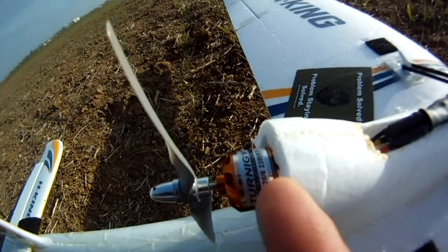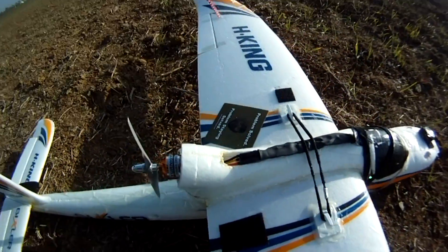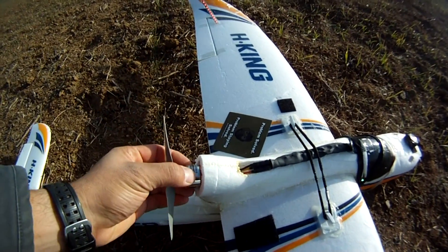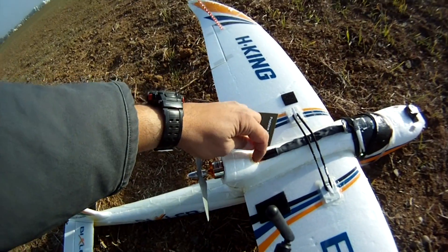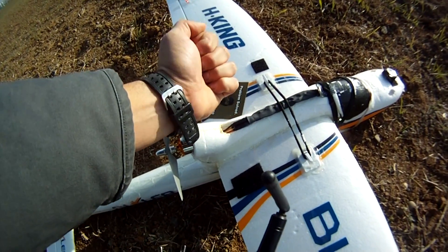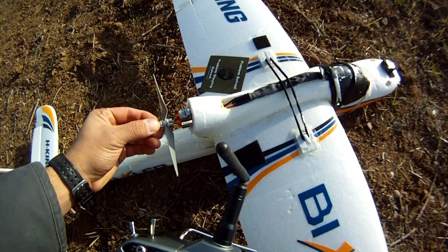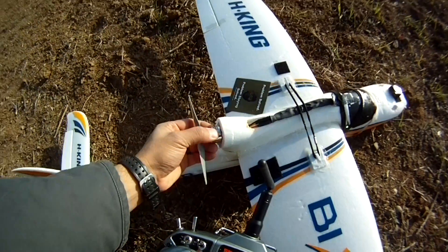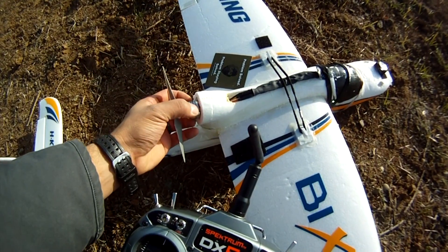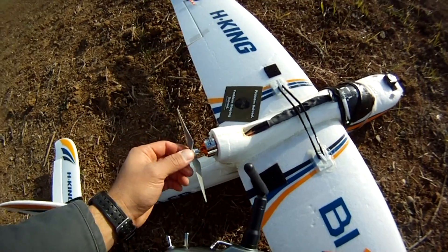I had to cut away a good portion of it so I could rip out the wood bracket that's back here. I just wiggled it loose, and it's a pain in the butt to get the screws out back here. I had to shove a screwdriver in there and then get some needle nose pliers and turn it so I could get grip, so it would lock into the little channels, and then loosen it that way, and wiggle it back and forth to break the glue. Then I finally pried it all out.